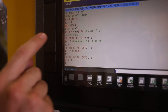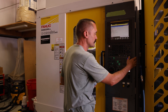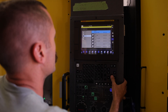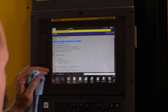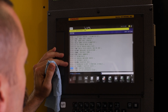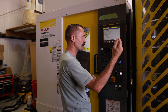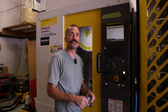What we're going to do right now is hop over to 9760 and I'll explain why I didn't have to tie into another air relay and do some crazy out-of-the-box thing. We'll jump over into our systems and scroll up to 9760 — the Renishaw settings. There's a bunch going on, but if we come down right here, number 125: air blast. A zero would be off. A one is partial, which I believe just means that it does an initial blast at the beginning of that tool break detection cycle. And if I change this to a two, it's going to blow the entire time the tool is coming down to do the tool break check.